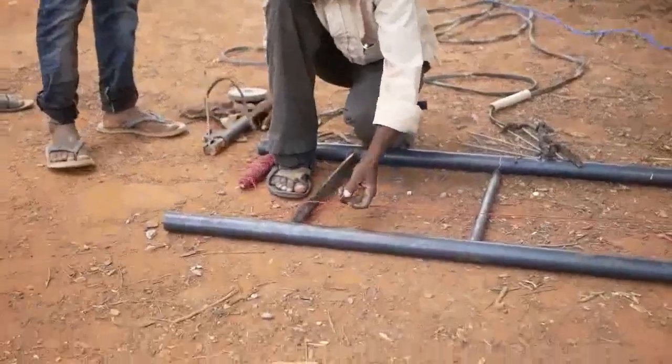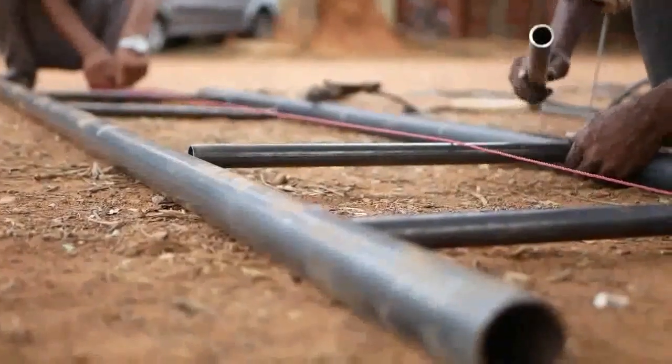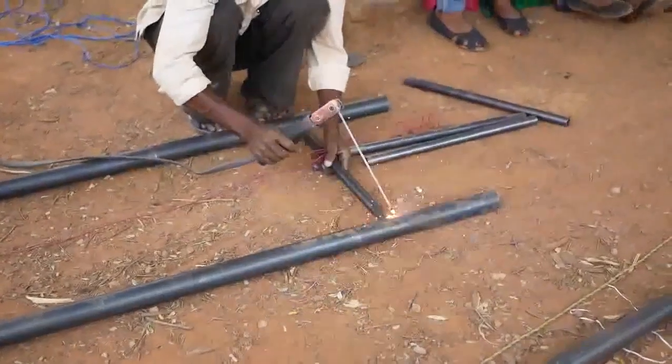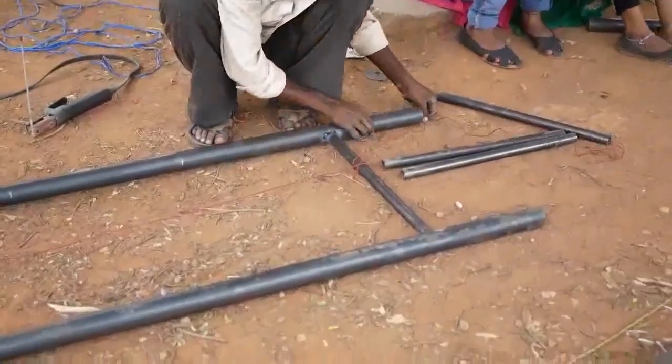Here's a clever little rope trick that local welders were using here. Just tie a little bit of string around one end of one rung of the monkey bars and around the other end where you've first done your tack welds. Then once you've got them, that'll give you an exact height where all of the other pieces will be able to sit at the same height. Clever little tricks like this — just talk to the local builders, they'll be able to help you out a lot.